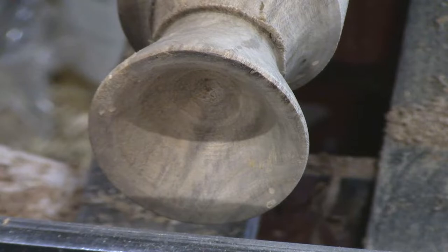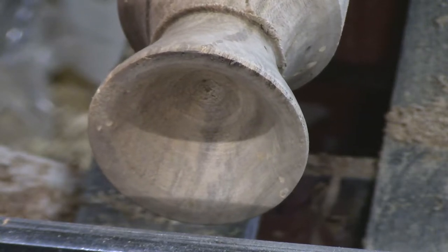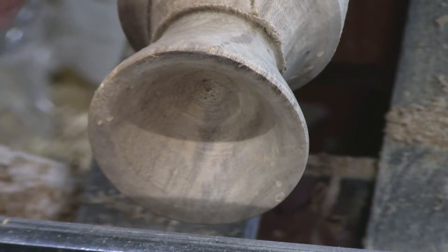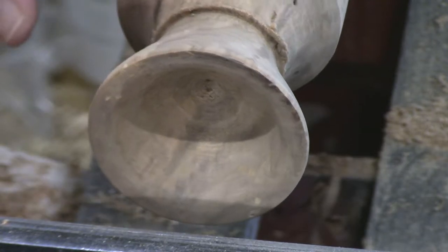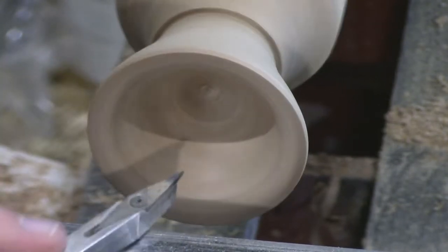Keep right on charging. I kind of like working with a little pointy guy. Would I ever put wood hardener on a piece like that? Yeah, this piece, if I hadn't just grabbed it out of the shed here this morning, first thing, this would have been nice to stabilize. And then it would become more of a hybrid resin piece. But yeah, you can certainly stabilize this guy and help with that punkiness that's right in there. For sure, Art.